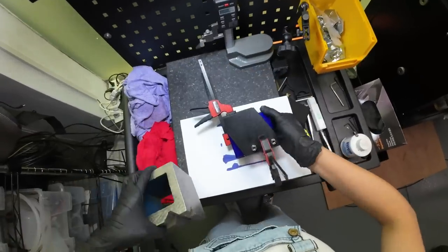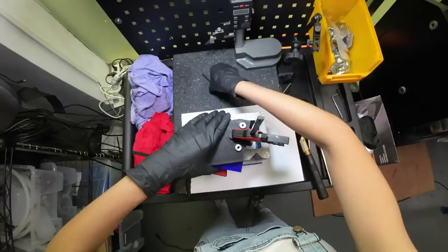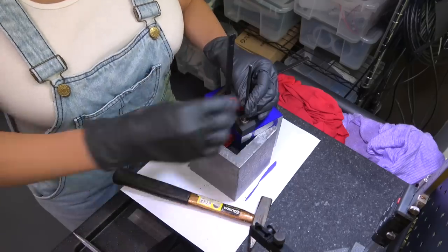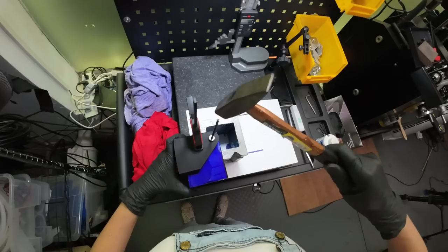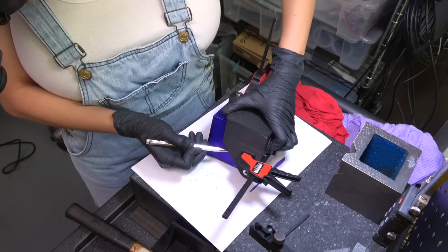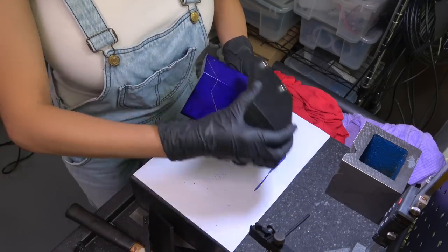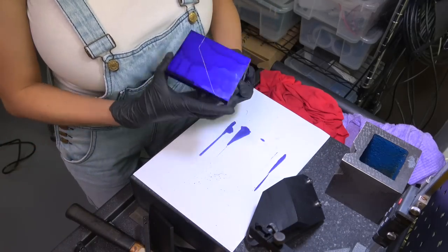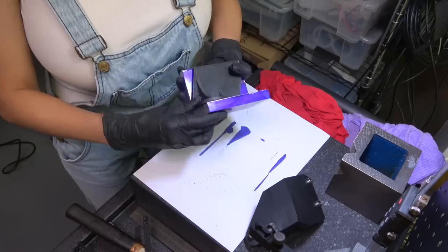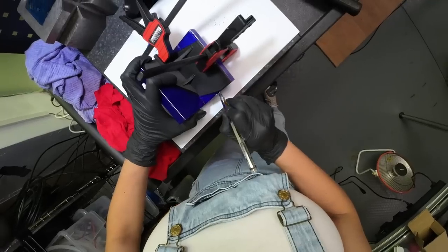This time, instead of using the bushing for a drill bit, I'm going to use something called a transfer punch. It fits the bushing and will leave a small dent so I know where to position my center drill. This is an inside template to match the outside, so I can see where to cut when I flip the piece over.